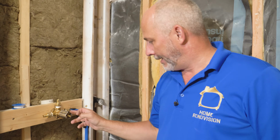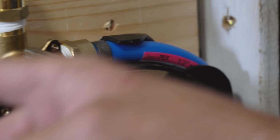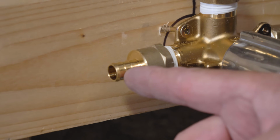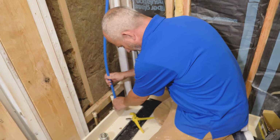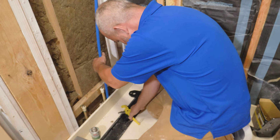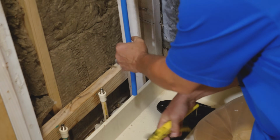The secret is to have it no more than 1/4 inch from the fitting on the pipe. You force this ring compressed nice and tight around one of these ribs. Okay? And that is where you get perfect water control. We are simply going to be bringing this over, and because we have the little bit of flexibility here, we're going to eyeball this. Okay?